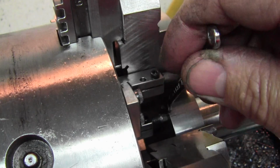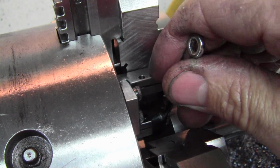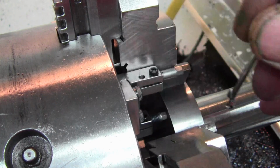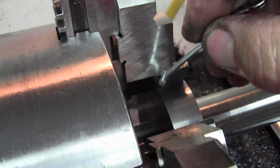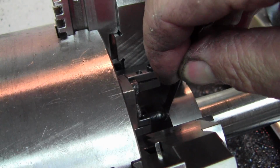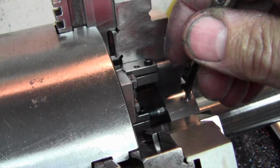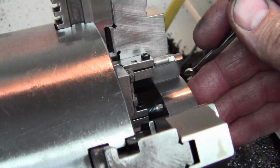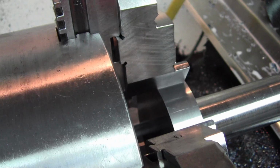We accomplish that by being able to come in here and get on these little wrench flats on these risers and actually jack this, skid it in the jaws, and get that tail end to run true just by using those 3 points. Just like you'd use a buck chuck, you use these 3 jack screws to bump this around, and of course obviously then it firmly supports this against the end thrust of the roughing cuts. So you can see these stops are fairly versatile and quick.